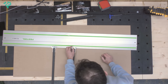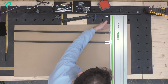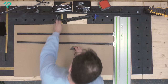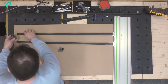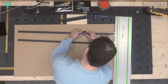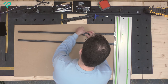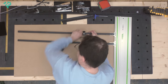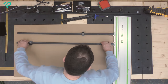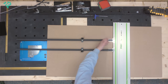Take the second bracket, slide it into place, hold it down and lock it in — space them out more than shown here, that's just so it's visible on camera. We then take our guide stops and slot those onto the rail. I'm going to bring mine up to the 500mm mark and lock it down — same on the other side.